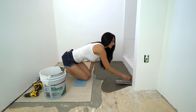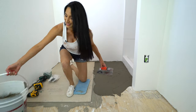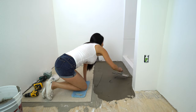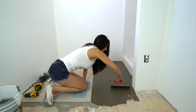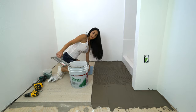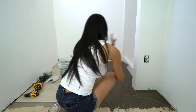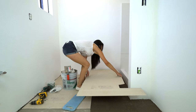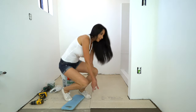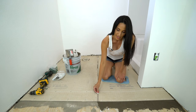I'm trying not to scrape the shower — brand new shower. Just work it down. Next piece. Push it a little bit here. Make sure you have a one-eighth inch gap in between the boards, and you can even use a spacer for that.